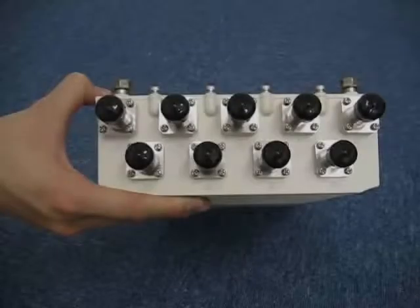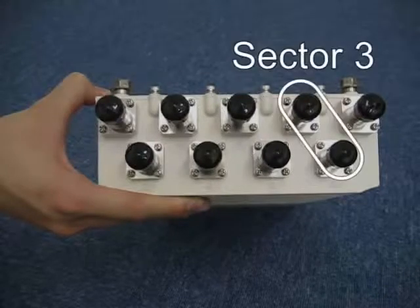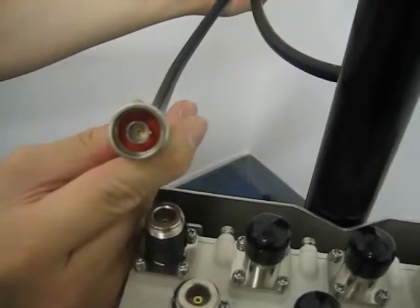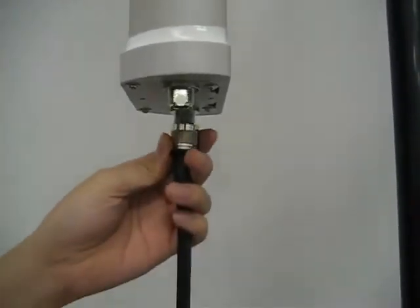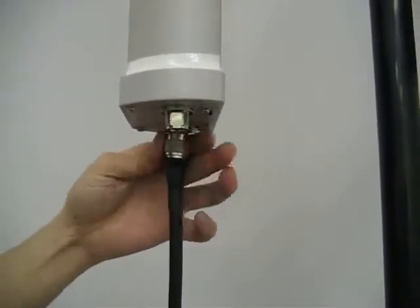In this part, we are going to connect the RF cables to the RF ports of the A8 main unit and the antennas. On the A8 main unit there are 8 ports labeled 1 to 8, divided into 4 sectors: Sector 0, Sector 1, Sector 2, and Sector 3. Now we connect the antennas to their respective sectors. Please make sure all the RF cables and connectors are completely dry before installation. Loosely connect all the RF cables first, then secure the RF cable bundle to the pole, then tighten the RF connections. Remember that the left port of the antenna is always connected to an odd port number of the A8 and the right one is connected to an even port number.